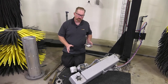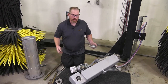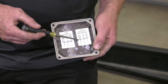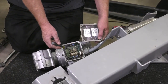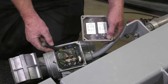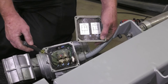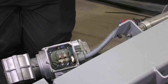Now that the motor is disconnected from the framework, there will be the actual disconnection and reconnection of the electrical. You'll notice that in the cap that comes with the motor there are two different schematics — one for high voltage and one for low voltage. The bridges for the posts inside the box need to match the schematic for the incoming power. In this case we have 460 volts, which means the bridges are between three positions and the incoming power leads come to those three posts. Improper voltage connection will shorten the life of the motor, if not ruin it completely.